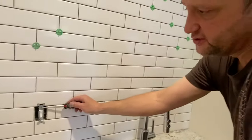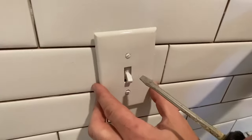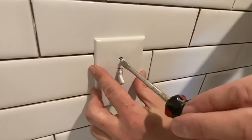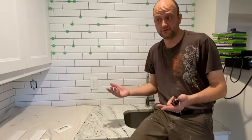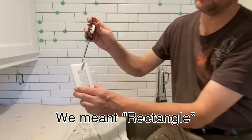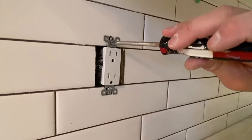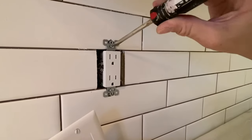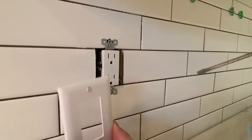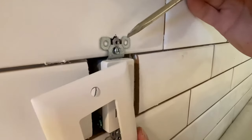With this particular switch, the screw for the plate goes into the receptacle portion that is below this screw, so we can go in, put that on, and then that screws in. Now some outlets and switches to keep in mind are of the square type, where the screws are actually going in above the set screws. In addition to cutting out this little notch for the set screw that screws the outlet into the electrical box, we need to keep in mind that we are going to have to remove enough tile for this screw to go in, because if you have tile behind that, this screw will not set.